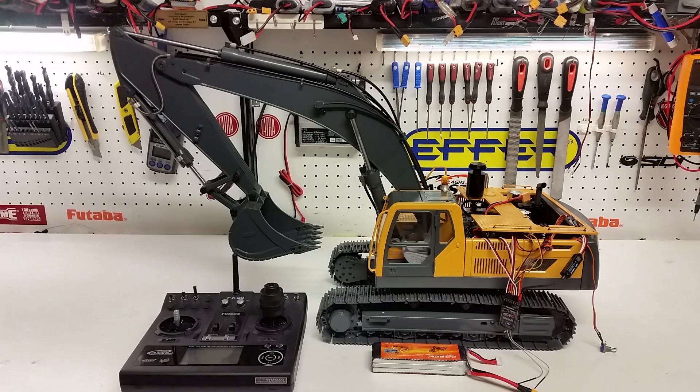The flow through the venturi ports in the new hydraulic valve are so good that you can run three functions simultaneously and it's quite smooth — the flow of the cylinders and rams are very smooth. Let's go closer and see what has been done and how it's been done.